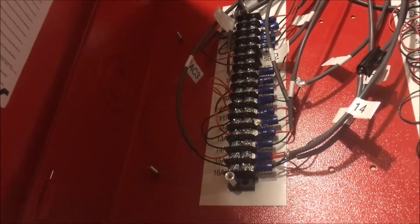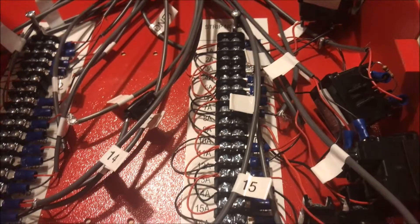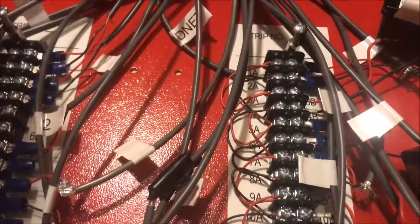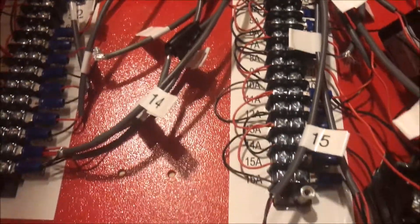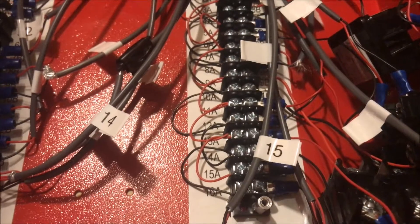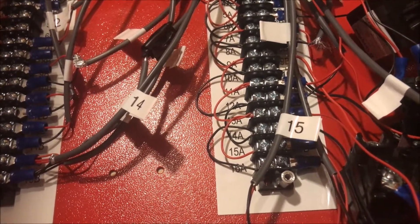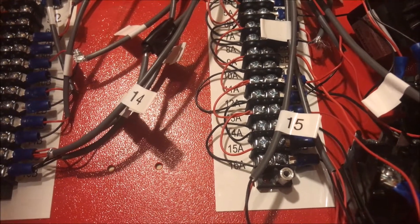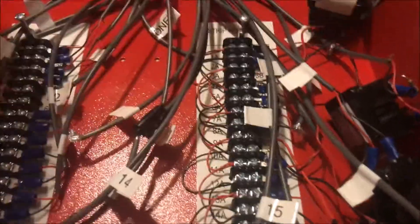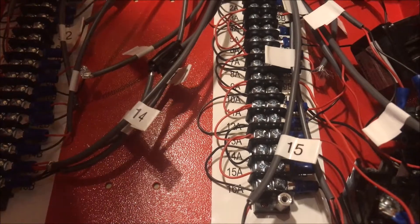For my NAC I'm also T-tapping, which isn't totally allowed since supervision doesn't work, but we don't care about supervision here. The way I have my ID net channel wired is: this whole side is my ID net channel. One cable comes from the panel labeled ID net, and then there are red and black jumpers going all the way down, so there's a positive and negative for each point on the panel.